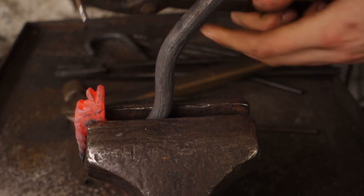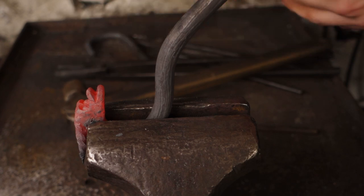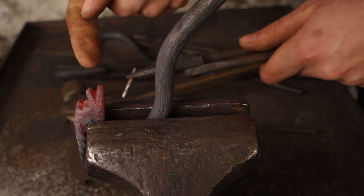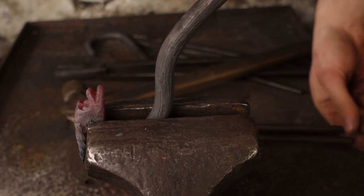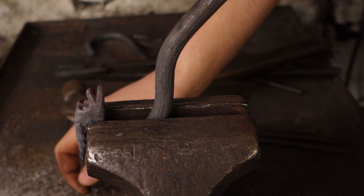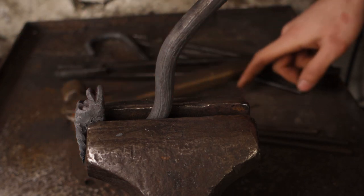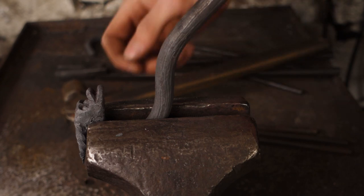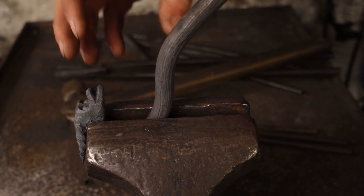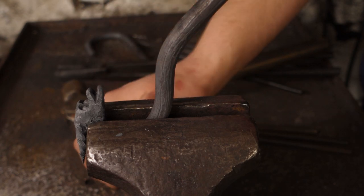I'm going in with a little piece of 4mm round bar, and that's to create a bit of a flat spot in the mouth, so that we can then drill a hole and put a piece of 4mm round bar into the mouth for a tongue coming out. This is something that Bill Carter mentioned to me a long time ago — he said this was something he would sometimes do with his dragon's heads, putting a tongue coming out of the mouth. Bill Carter taught me a lot about blacksmithing and making animal heads, in particular the ram's heads. I'll leave this to cool down, and then we can drill the hole. I'm going to try and cut a thread on both so we can screw the tongue in, but we'll have to see if that's going to work.